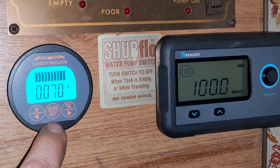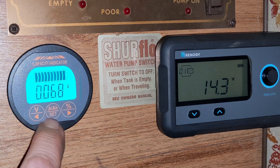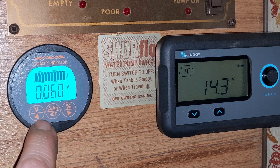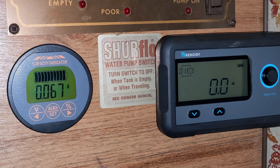You have to turn this thing back on if it gets below about 100 milliamps — it freezes and shuts off the light. I'm pretty impressed with this charger. It seems to do what it's supposed to do: it keeps the current up near 10 amps right up until it breaks 14.4 volts, and then it tapers the current down and shuts off. That whole process only took about half an hour — I did a time lapse on it. Mind you, I only had to put a couple percent of battery capacity in.